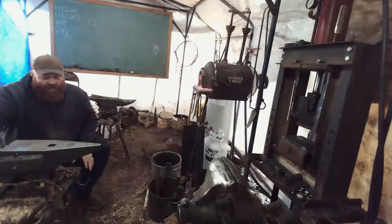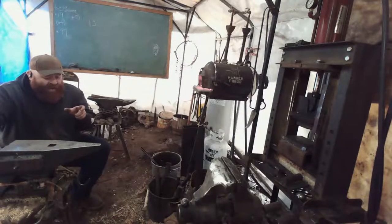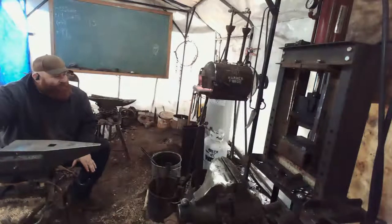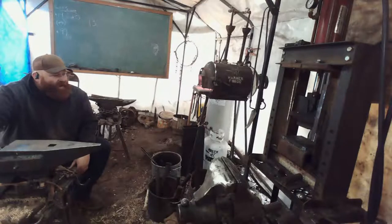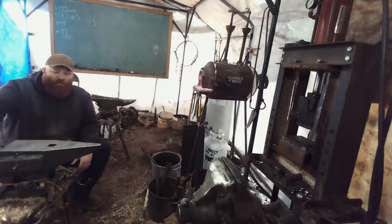This doesn't have to be that big. Maybe 2 inches wide, but it's going to have a rounded nose and maybe a blade length of 2 to 3 inches long. And so we're going to use about an inch and a half of this underneath the press. So we're going to go right at half, or as close as we can get to half, and get all that flat spotted. Then we'll draw out our knife for the blade side of the adze, and then we'll drift it down through.